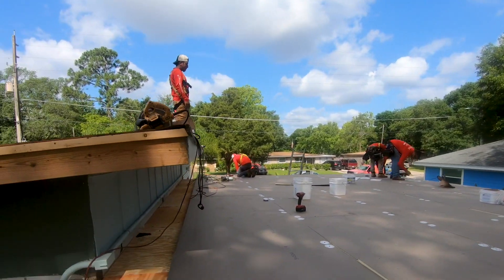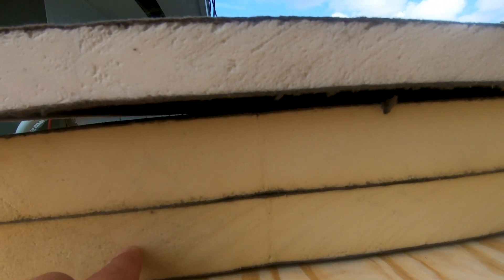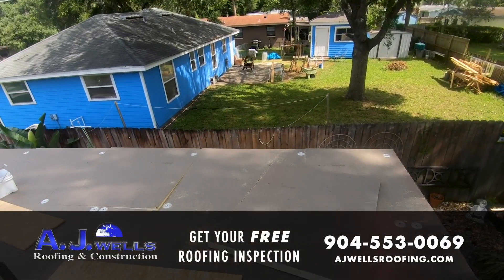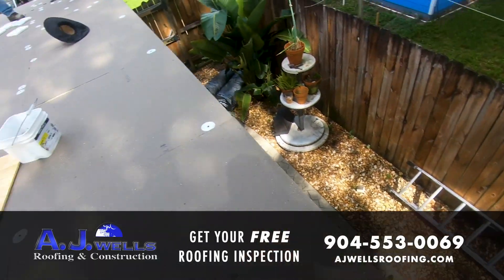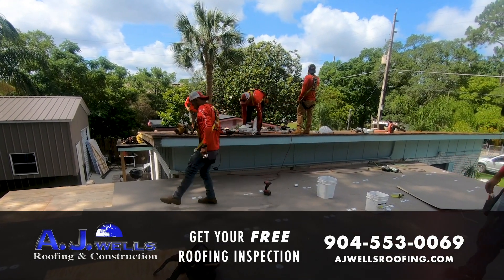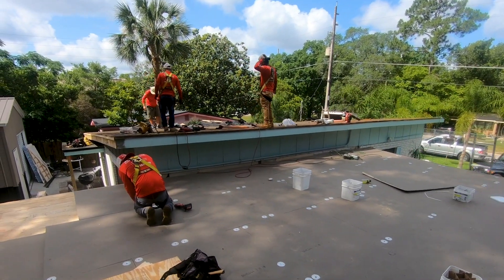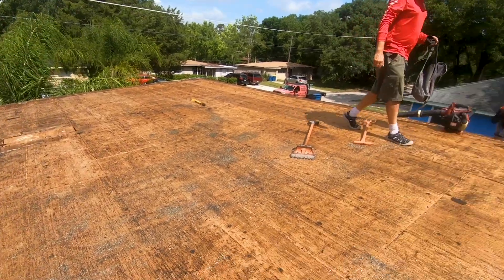You can see where the ISO board system creates a taper — you have intermediate two-inch fillers and then a slightly tapered one that goes on top. When you go from the eave all the way to the back of the house — about 21 feet from the eave to the roof-to-wall junction — the thickness of the slope builds because you're going from a quarter-on-12 slope. At the highest point, the ISO board is going to be about five-and-a-half to six inches thick. This roof already has a slight slope, so we won't need ISO board on that section.